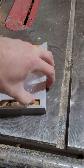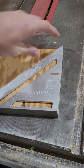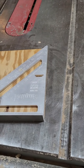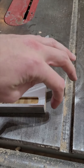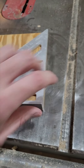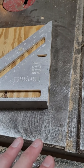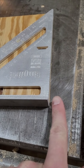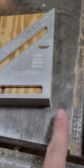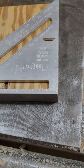What you end up getting — I'm just setting this up right here — there we go. I've got the top of this 90-degree reference surface flush on the edge up here, but there's a hairline showing right here. This tells me that this is not perfectly square, but that's okay because the amount of error we're seeing here is compounded five times.